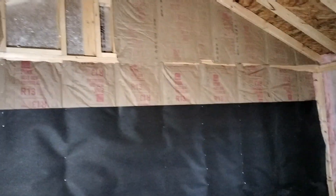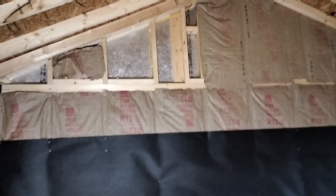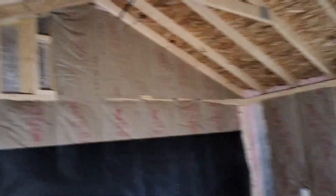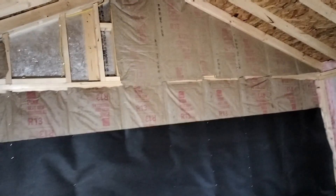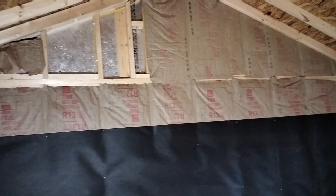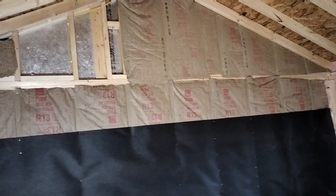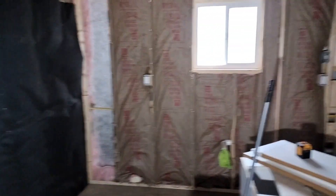Here's the back wall we're gonna work on. I'm gonna finish up the gable end up there and take the tongue and groove partway up, because the ceiling will be flat across the center so we don't have to go all the way up with tongue and groove — about 16 inches above the top plate there.